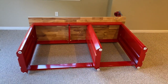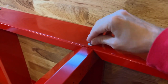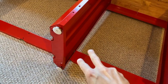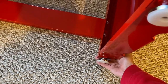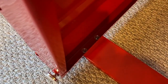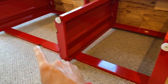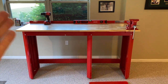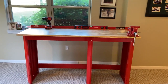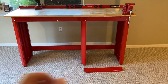Secure the bolts, washers, and nuts, then tip it back upright on its feet. With the square holes lined up, the bottom portion of the bolt has a square — insert that, come up underneath, add the washer, and then secure it with the 7/16 nut. I've got the bottom two secured and one up top. I carefully grab right here to lift up and shift that bolt underneath and through the hole, then secure it with the washer and nut. Bench is now back upright on its feet — just be careful of that rear rail or splash guard, as it can bend very easily.